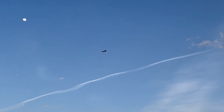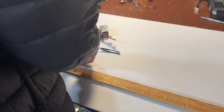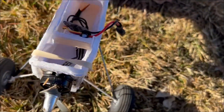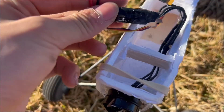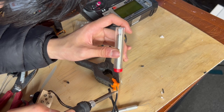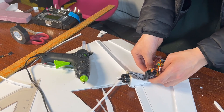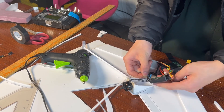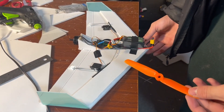I haven't had much luck with flying wings in the past. Most of the electronics I used were just stripped off old planes, so as you'd imagine they were not at all the right size for a nano wing. I tried to make it work by soldering the right connection pins, but in general these oversized components add a lot of unnecessary weight, drag, and take up a lot of space, which ultimately weakens the lift generated by the wing. Probably the biggest issue was having a big motor and a big propeller.